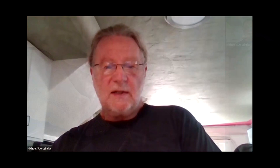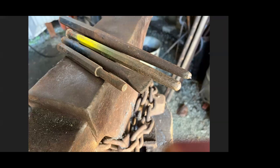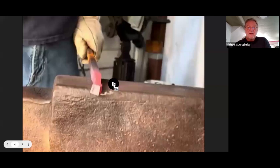This is the hook that we end up working with. I start with half-inch stock. I only use four tools: a chisel, what I call a hollow punch which leaves a domed shape — I made this tool with a flat punch by drilling a small depression in the top and grinding the edges so they're equal and come right up to the edge of the hole — and then two round nose punches: a smaller, very long one and a shorter, fatter one.